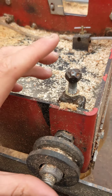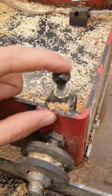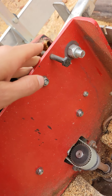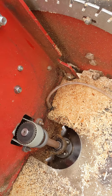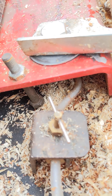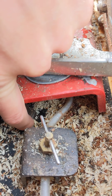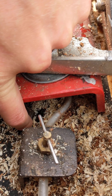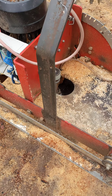One of the issues I ran into is that it can be really hard to get these adjustments right. Specifically, this point and this point here — this controls the depth of your cut, how far it goes up and down into the log. This screw isn't touching the bottom plate, but we're still cutting a little high on our logs. That's something that maybe could be fixed by adjusting some other part of the frame.